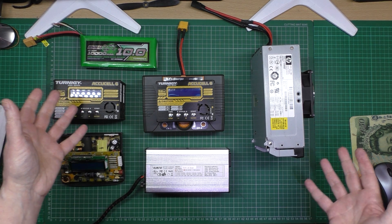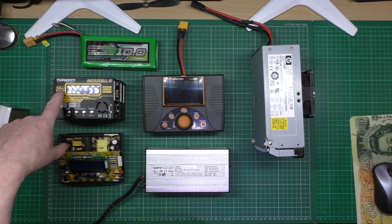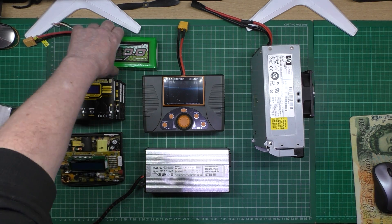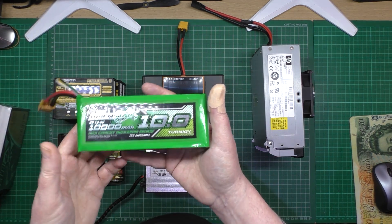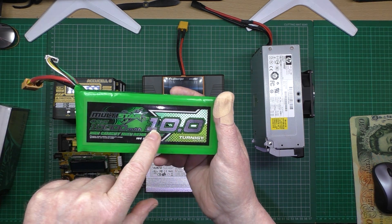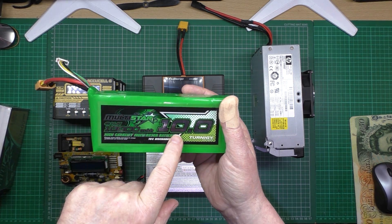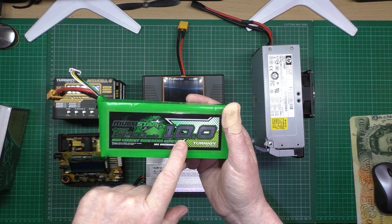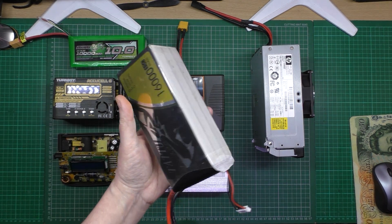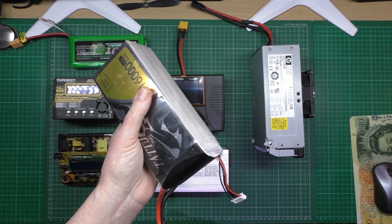So that's how you work it out. Obviously the higher the wattage, the more you can put into batteries. Now, LiPo batteries — I only ever charge them at 1C. Even with a pack where 1C is 10 amps, I'll charge at 5 amps and won't go above that. It does prolong the life of the battery.